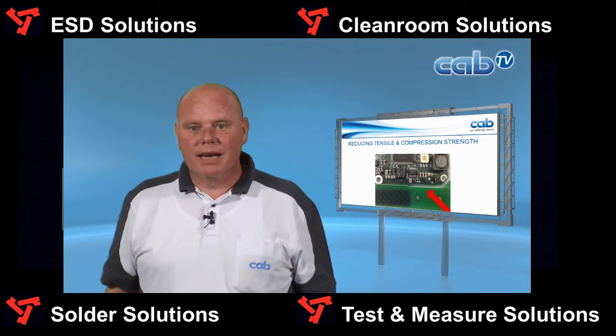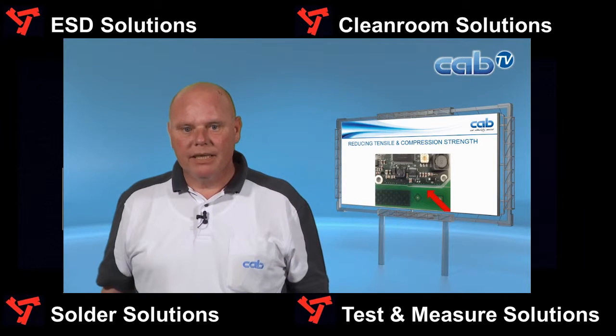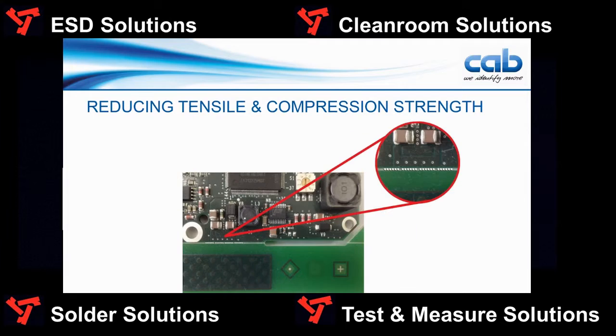We have just discussed the number of cuts, but there are more possibilities of stress reduction. For example, milled cutouts along the pre-scored groove. If there is not enough space for milled cutouts, drilled holes along the pre-scored groove may help. There have been various measurements on both procedures. They finally confirmed that stress now tends to zero.